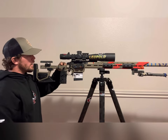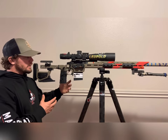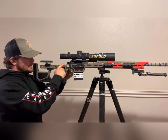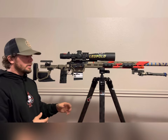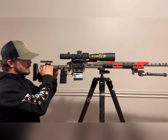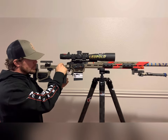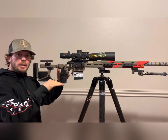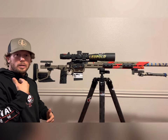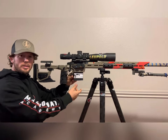There's a level built into the chassis, which is a nice feature. But what I really want to highlight is this cut right here — this is a change we made after original production because I wanted the action to sit lower in the chassis so that the line of recoil sits more even with the stem of the buttstock. This groove drops the action and lifts the buttstock so the recoil force sits higher on the collarbone, helping with recoil management.